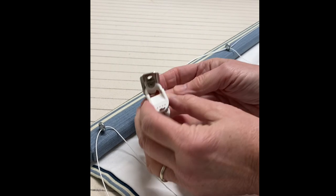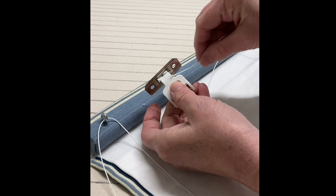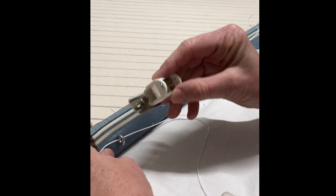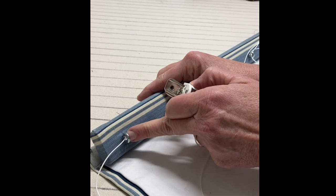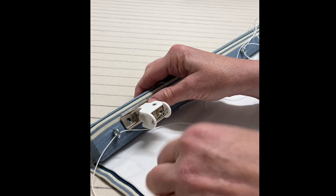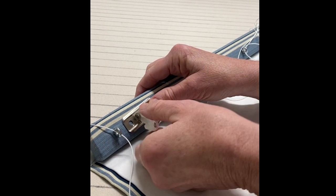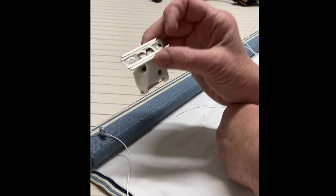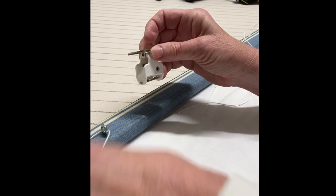These cord locks have openings on both ends so that you can take strings from either direction and feed them in from the right or from the left. People often think you have to put the cord lock on the very outside of the shade, but I never do that because it always interferes with where my last screw eye is. So I usually set it in a little bit on the board, and I'll then be able to string it from both directions. As I showed you, these rollers have to separate — so give them a shake to make sure they're separated, and that makes it really easy to feed the strings through.